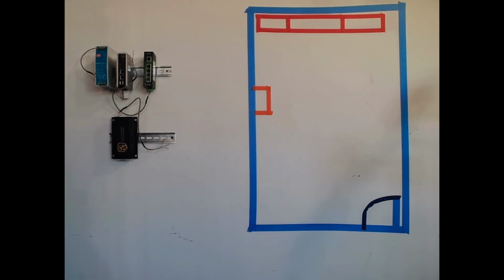So this is the core setup of the unit. I'm going to terminate all the wiring. Again, I'm going to use my screwdriver here with a pointer. We're going to go DC negative, DC negative, DC positive, DC positive. So what I will do is from left to right, I'll do terminal 1 and terminal 3 to get my 12 volts. And I will do terminal 2 to terminal 4 to get my 12 volts, so that I don't have all the wires landing underneath of a single terminal. So when I get that done, I'll pop back up here and I'll show you guys. And we'll try to take the camera in a little bit closer to get a look at it.